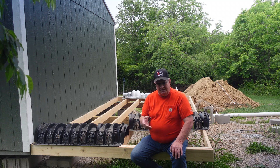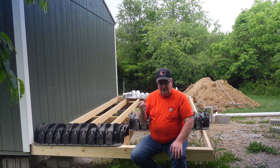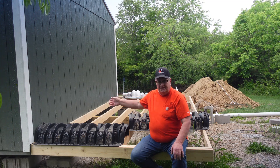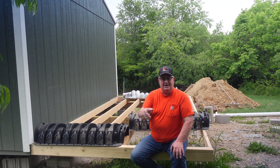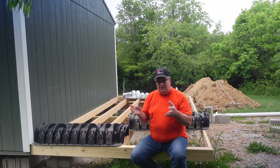So last weekend we set the tank and the sewer line all the way down to where the distribution box is going to be, and all the schedule 40 pipe all the way back up to the house where it's going to tie in at. And we have all that set.